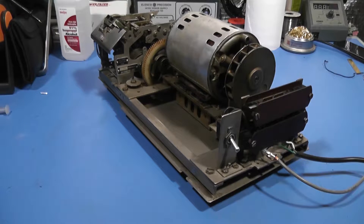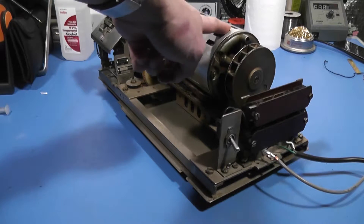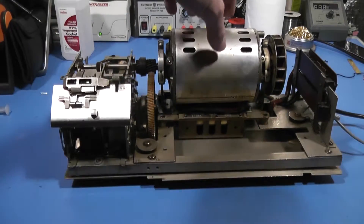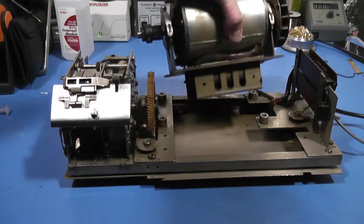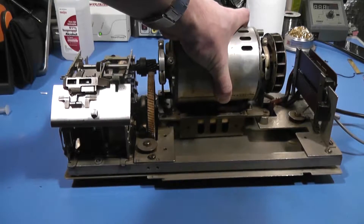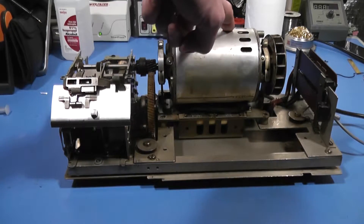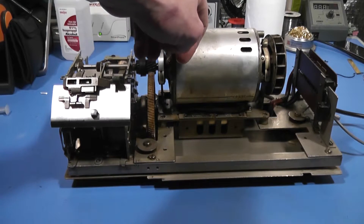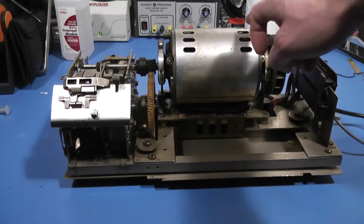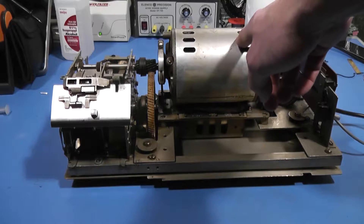It could burn something up. Now the motor does have an overheat sensor in it, so if the motor is getting hot or shorted it should shut off. But if there were a short somewhere else in this unit, it's not fused. The motor unit itself — this is an LMU, the model 28 motor unit, the same motor unit that is in all of my model 28 equipment. There are several motors available; this happens to be a synchronous AC motor, which is what all of mine have. There is also a DC governed motor available, and for this particular unit there is a much smaller synchronous motor that allows it to be mounted on a smaller chassis.